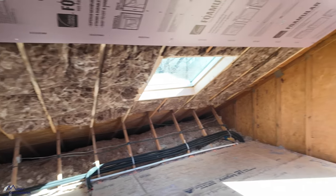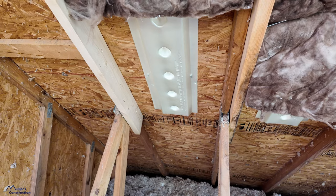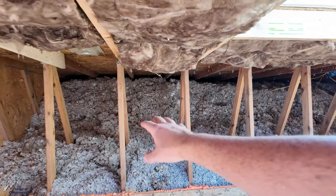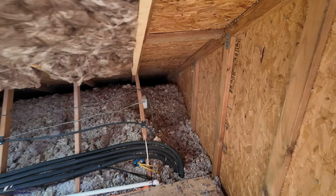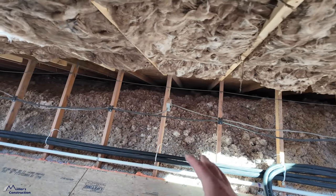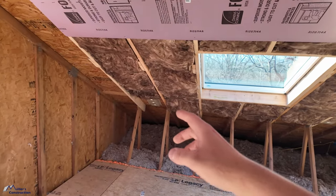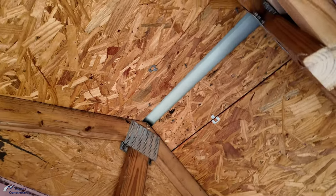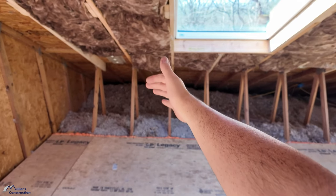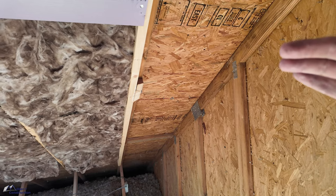This is the detail we've come up with. I left this little piece out so you can see we do have an attic baffle — it's a Dura-Vent. This will draw cool fresh air up from the soffits. Bear in mind we did not blow in that insulation — it's not our job. There should be baffles at the eaves, and though there aren't, I can see daylight down through there so it shouldn't be an issue. Below us is an unconditioned garage space, keep that in mind. We've decided to vent all the way up to the attic. You can see we've got a nice ridge vent so the fresh air drawn from the soffits can run up the attic baffles and exhaust out the ridge vent. So we still have ventilation on the bottom side of our decking, but we're also insulated.